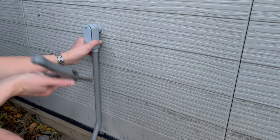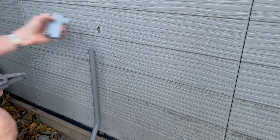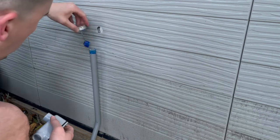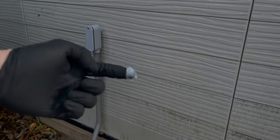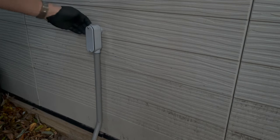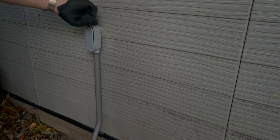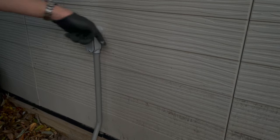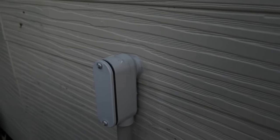We're off by about a quarter of an inch so I'm just going to clip a little bit of this off. I'm going to take some clear silicone and just put a bead around where this conduit body enters the shed. This stuff is pretty messy so it's a lot easier if you just wear a glove — you can get a nice clean bead over it, smooth it out, and wipe off any excess.